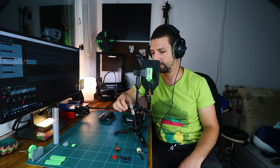So this is how the ferrite core transformer sounds like. First of all, it works, but it seems to have less body, and you can hear it picking up a bit of interference. You can hear it clearly if I touch the transformer. It is actually the first time I'm getting such an obvious interference, probably because it's the first time I'm using those microphones with a Cloudlifter, so I simply didn't hear them before that. It also seems to decrease a bit if I touch the audio interface. Or the connector.